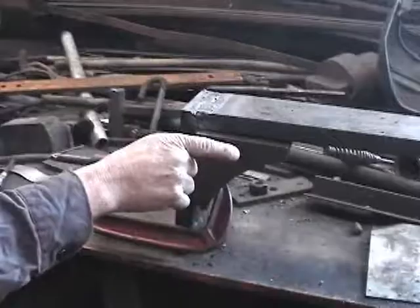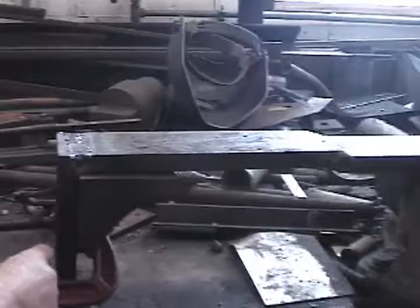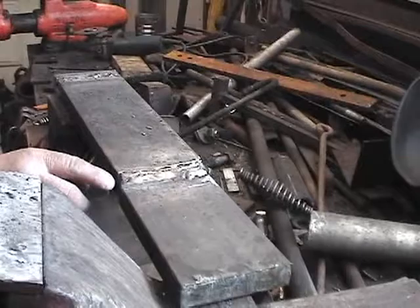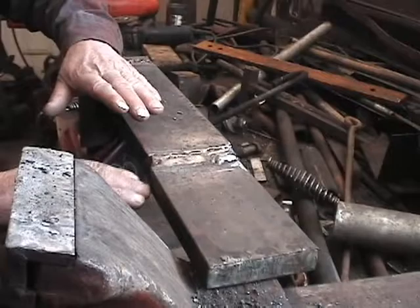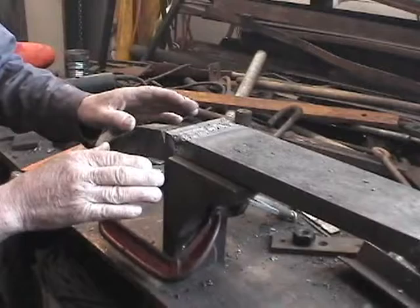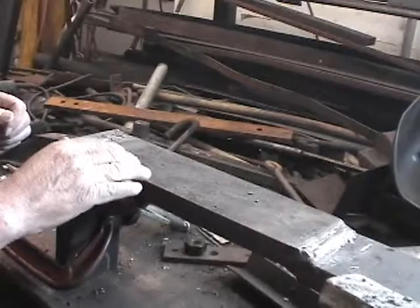This is the pilot brace. You'll see them on the car — there are four, but one was missing. Originally this was a bent piece of one inch by four inch steel. At the Laconia Car Company where this was made, they had a machine to put the offset in when the steel was red hot. For us that's impossible, so we're welding it up out of solid stock. By the time it's finished, you will not know one way or the other.